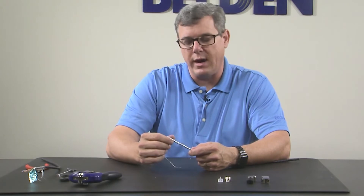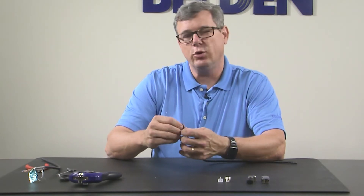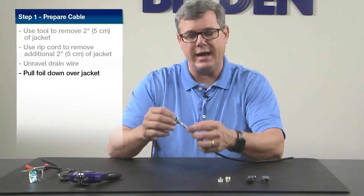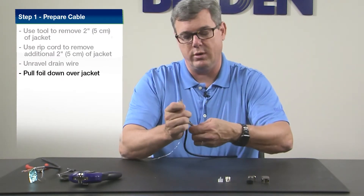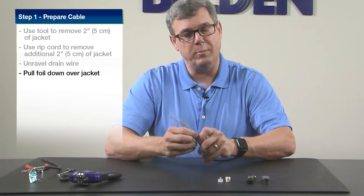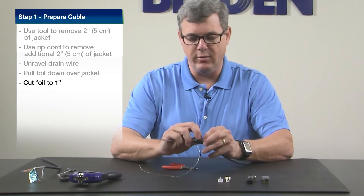Now, the 2183 product, when you look at the foil, has the metallic portion on the outside — the conductive material. On the inside is the Mylar wrap and coat. To make sure that we have a good conductor to ground, we want to make sure that we attach it to the foil as well. To do this, we want the foil over the jacket portion of the cable. As you separate the jacket down, you want to pull the foil down over to the jacket. Because the foil is outward facing, we have to fold it back onto itself, so we pull it down onto the cable. We then go down about an inch onto the cable, snip the foil, and peel that off.